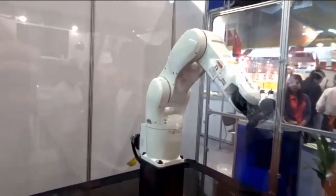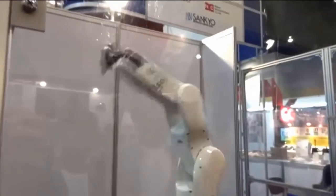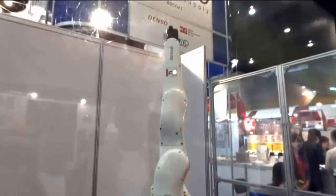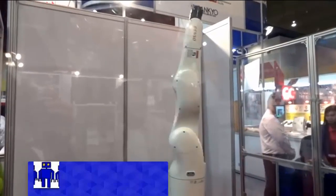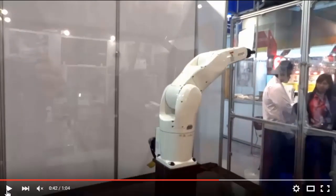To answer this question, let's start by taking a look at some of these manipulators that have as many as six degrees of freedom. Here I'm showing you a six degree of freedom manipulator moving around. As you watch this manipulator move, it might look very complicated, but in fact if we look carefully, we can see that it's actually just two pieces of individual manipulators stuck together. Let's pause the video here. This joint, combined with this joint and this joint, together make an articulated manipulator — a three degree of freedom manipulator that we've learned about previously.